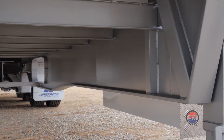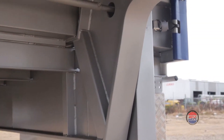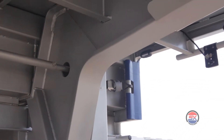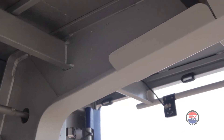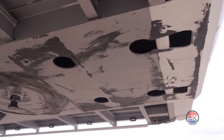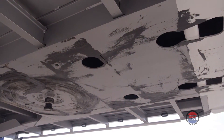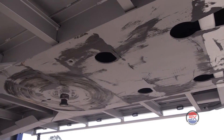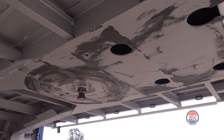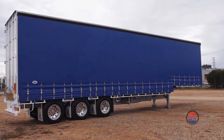The frame has a 12mm top and 16mm bottom continuous main rail flanges with a 19mm bottom flange up and over the gooseneck to assure maximum strength throughout the drop deck chassis. The skid plate is a reinforced 8mm fully welded steel plate with a 50mm bolt-in kingpin set at 1340mm from the front to suit the most ideal payload and truck combination. This dimension also allows this unit to be used as a tag trailer in a standard B-double combination.